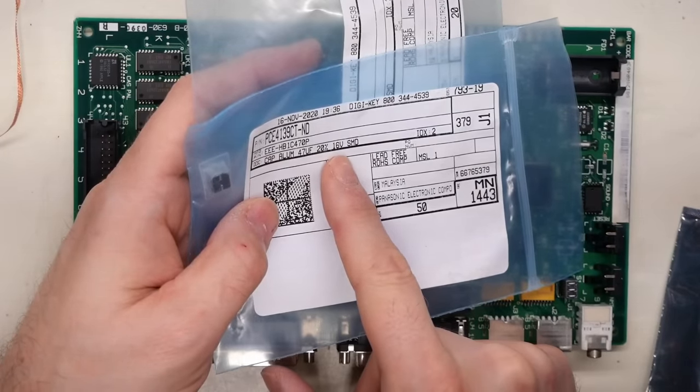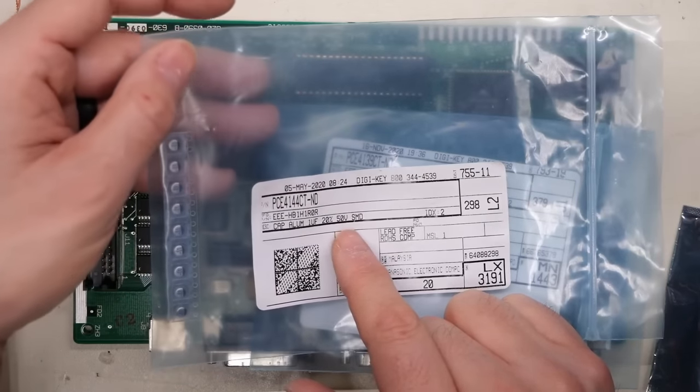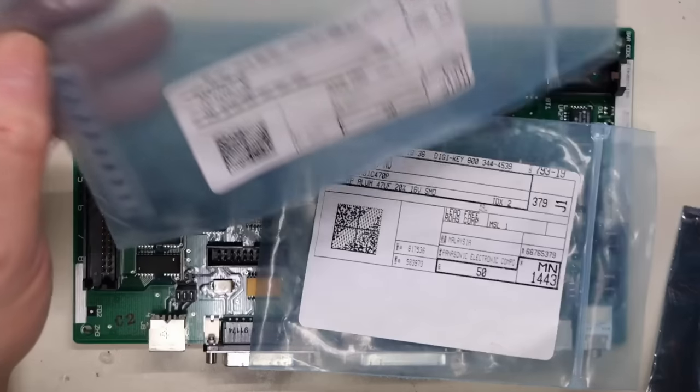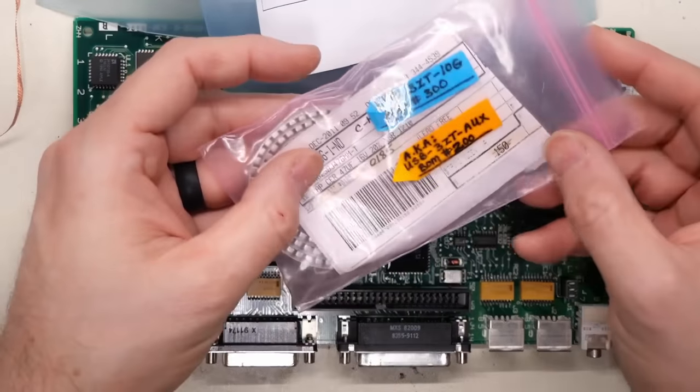I think the originals were 16 volts, so 16 volts or 25 volts will be totally fine. And it used one microfarad, and I don't remember what the original voltage value was, but this 50 volt part right here will be fine. Now, unfortunately, I only have one of these in this bag here, so I'm gonna be using these caps instead,